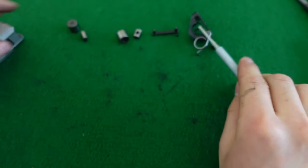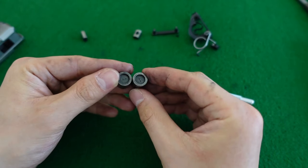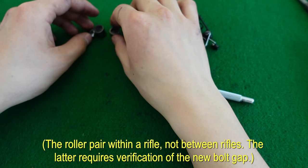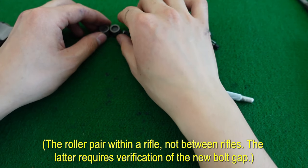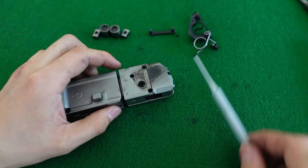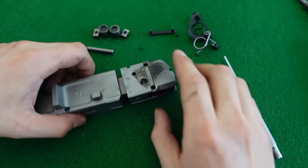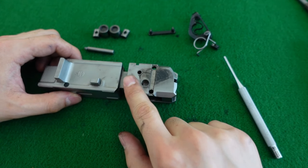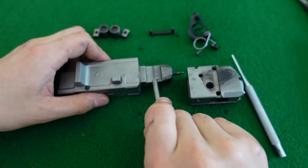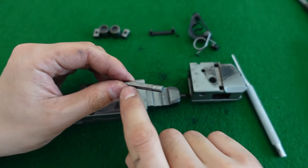The sets of rollers are basically interchangeable — you just need to make sure they're the correct size. In this case they're both minus-sized, so you can swap them around and the system self-adjusts. Now that the bolt head is mostly stripped, I can separate it by pushing the cross key — by moving the bolt head just a bit forward there's a position where the cross key can be removed via a clearance cut that allows it to be slid out.